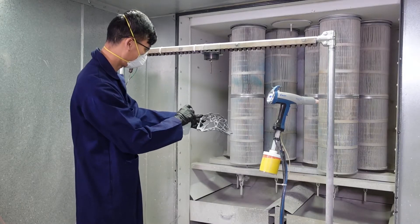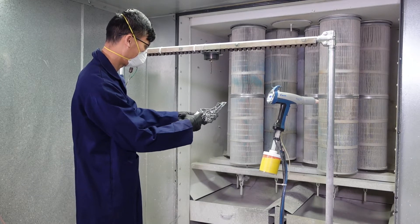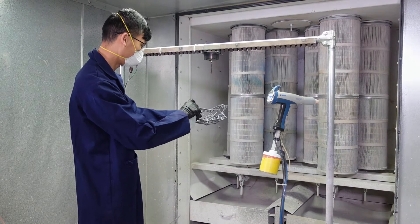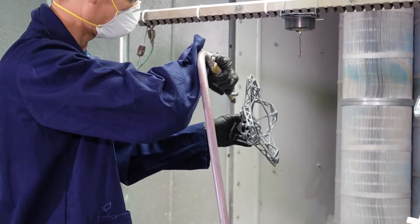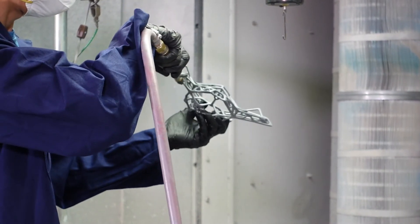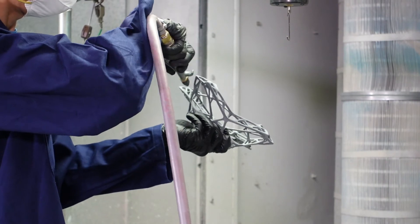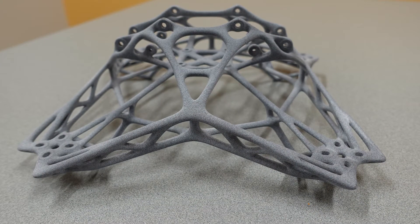Let's begin our coat and cure demo. Hip is applying a conductive agent and will immediately follow with a compressed air cycle to dry any excess primer. If a material is non-conductive, a conductive primer may be necessary. This primer allows for a material such as this 3D printed drone body to obtain a very thin and uniform conductive coat that allows for proper grounding and electrostatic powder deposition.